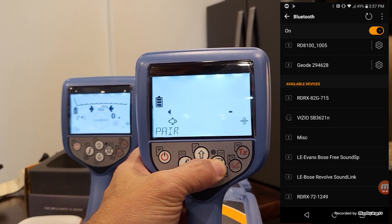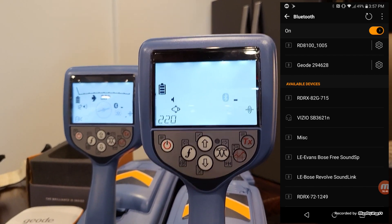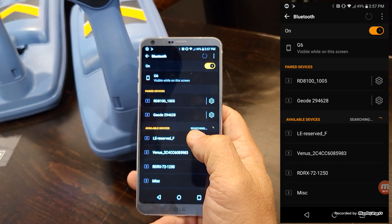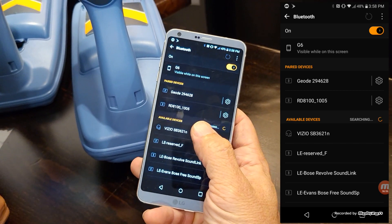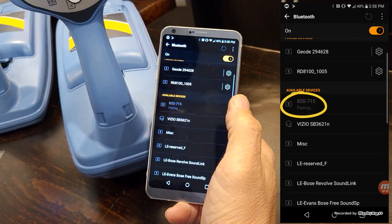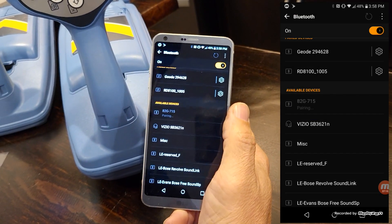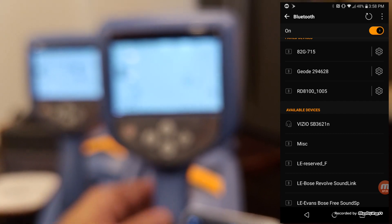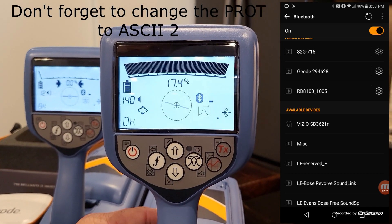Hit the left arrow and B will start flashing. Do a scan on your phone and look for the 8200. This one will come up with serial number 715. Go ahead and pair this up using the same code: 1, 2, 3, 4. Hit Pair. The phone's ready to go — now just wait for the word OK on the locator. There we go.